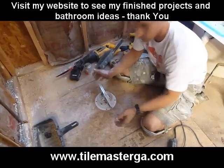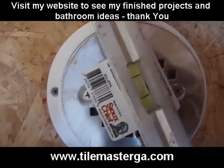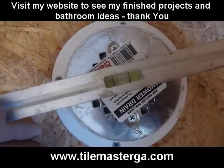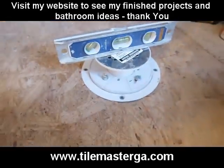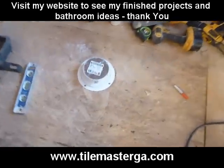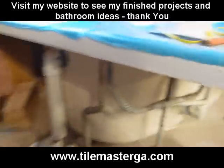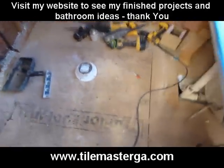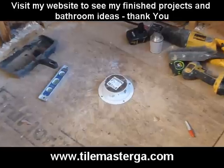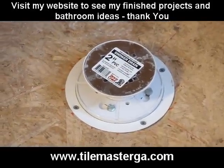This is a two-inch pipe — this is what's recommended for walk-in shower drains. We have inch-and-a-half in tubs, but right now you can see how nicely leveled this is. It doesn't move. Mission accomplished — subfloor replaced, drain replaced, ready to follow up with the rest of the items. Next will be the shower valve; we'll also be replacing the tub valves and fixtures. Thank you for watching and I hope this will be helpful in your own home project. Make sure to check my website for shower ideas — tons of pictures. Thank you.